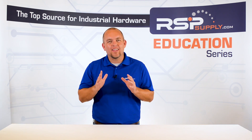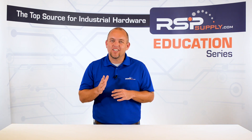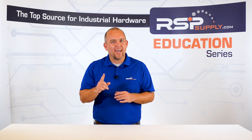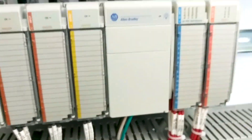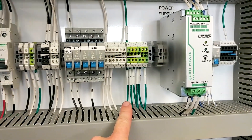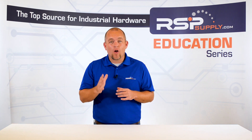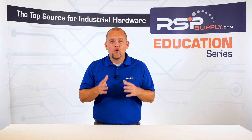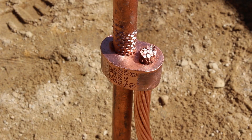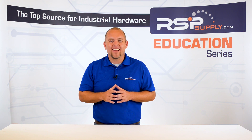So let's look at some of the ways we can avoid these problems. First and foremost, it is important to remember that all of the devices and signals within the panel be tied back to one single location within that panel. It is common to see several different devices within a control panel that need to be grounded. No matter the amount of devices in the panel it is essential to ensure that everything comes together in one location. This location is where the main utility power will enter the panel and is also where the main grounding conductor will be brought into the panel as well. This location can also be where the enclosure is grounded to an exterior ground rod.